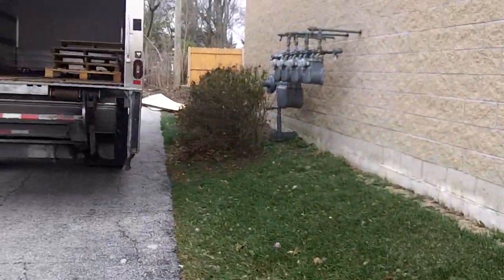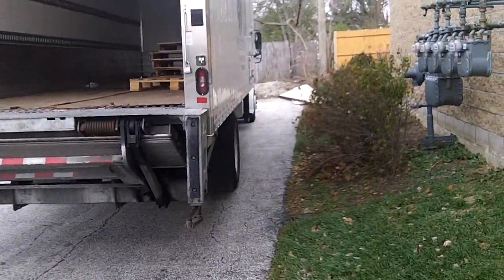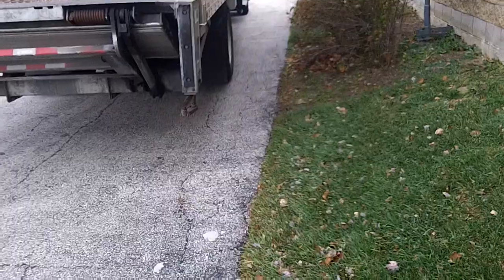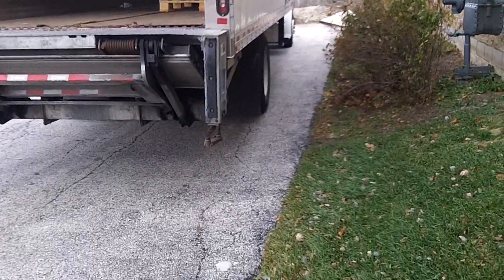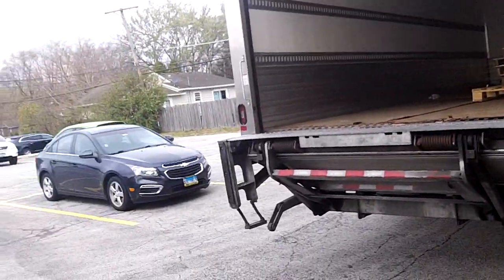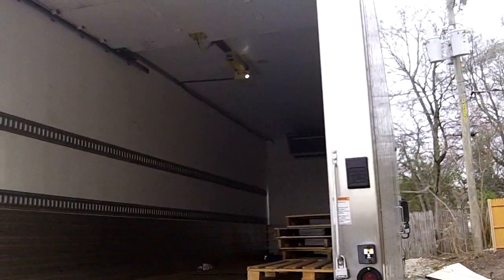It's worth its weight in gold. All the trucks we see here are totally demolished when they get here, these truck doors. The rollers are falling off, the hinges are busted. To spend less than $200 for us to do a maintenance will save you double to triple that in the long run, I guarantee it. Almost, I would say, 8 out of 10 trucks that come in here, the rollers are falling off, they're rusted, they're frozen. All you gotta do is squirt some oil, and there are maintenance videos I have out there on these truck doors. But if you don't wanna do that, just hire us to do it, and then we can do cables, check and inspect cables, tension, all that stuff.